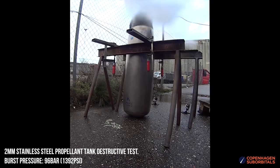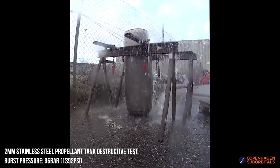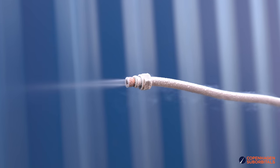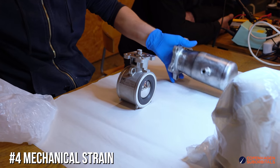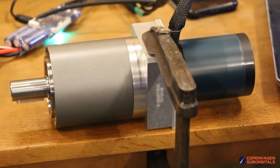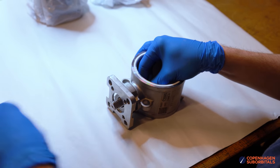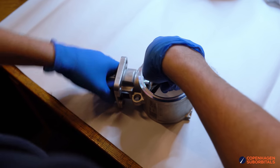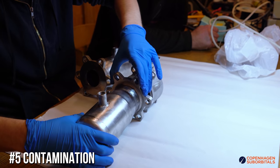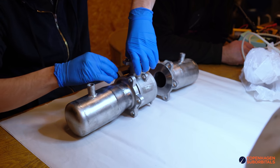At Copenhagen Suborbitals we only like scheduled rapid disassemblies, not the unscheduled ones. To prevent these overpressure events, we need to modify the ball valve so it has a way to release any excess pressure in its closed position. The fourth challenge, especially on large, quickly actuated valves, can be mechanical strain. Some materials become extremely brittle under cryogenic conditions, and with the large inertia of the ball valve and high-speed actuation, this could lead to the ball shaft breaking — so this needs to be considered in the valve selection process. Finally, when working with any valves in critical applications, especially in a liquid oxygen environment, cleaning and contamination prevention is a major priority. You do not want any contaminants to react with liquid oxygen, nor get mechanically stuck between contacting surfaces, preventing actuation and limiting propellant flow.